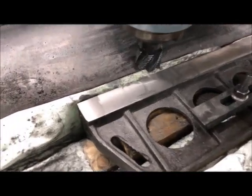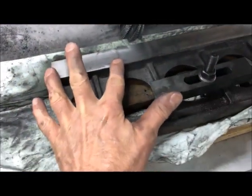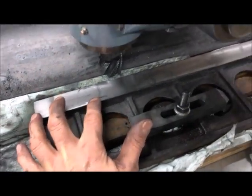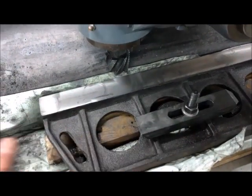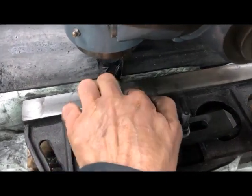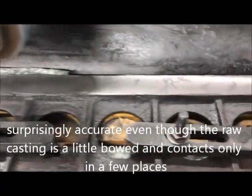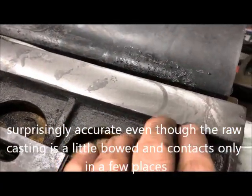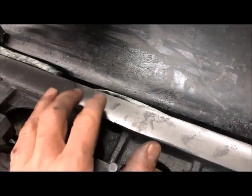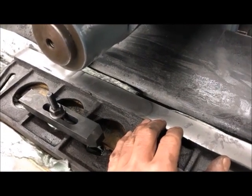So I'm fairly pleased. So I just have traversed and gotten the last 20 centimeters also, or 15 it was, on each side, just moving the workpiece in the slots. And still I measured and I get only a few hundredths deviation, which is scrapable, so to speak. And the finish is okay for scraping. So all in all, quite good. And this is of course a non-critical surface, but anyway, I think that method proved okay.